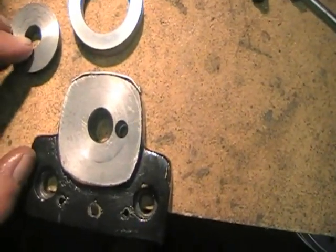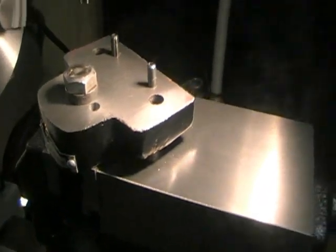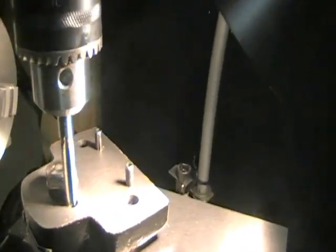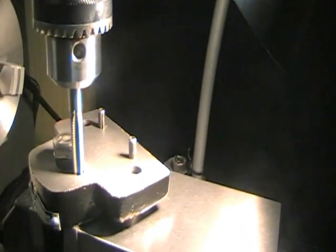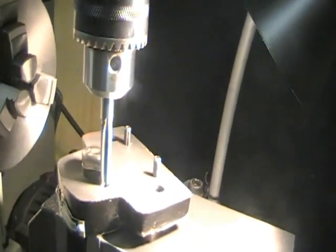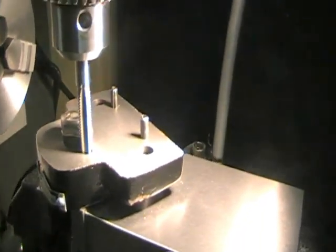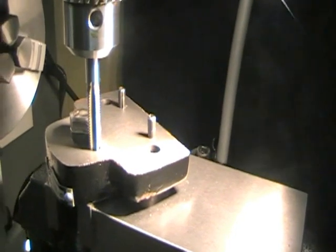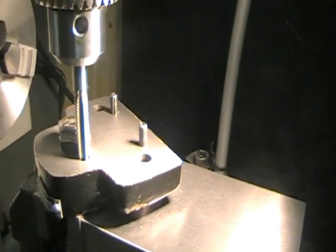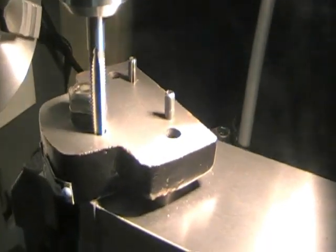I've spun the work over now, popped it back in the vise, and I've used the drill bit to align the hole to make sure the tap goes in straight. I'm not going to tap this out under power because that would be a big no-no. All I'm going to do is use it initially to start it off so I know it goes in square, and once I get it into about three or four turns I'll take it out of the vise, pop it over to the bench, and run it through with the normal handle that comes with the tap, and then we should be good.